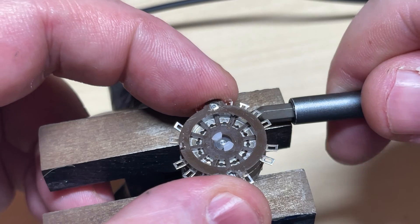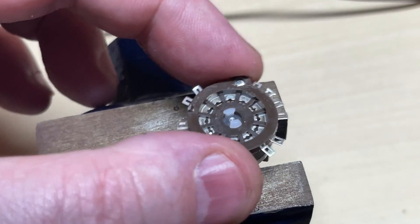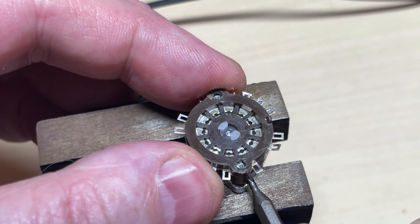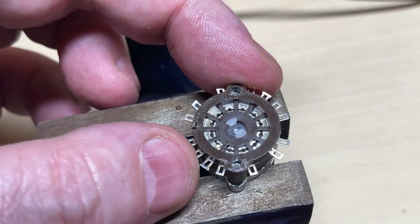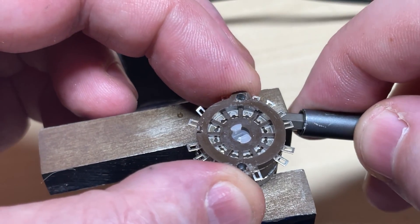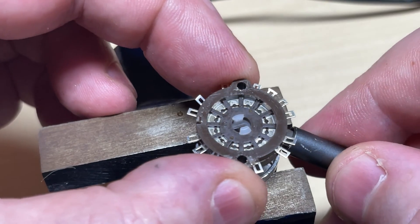Being very careful with this plastic wafer as it is quite brittle. One handy hint when soldering: do not leave the soldering iron on these pins for too long because it will melt and deform the switch and render it useless. Working from either side, we finally managed to prise off the actual wafer switch itself.